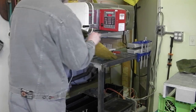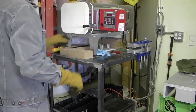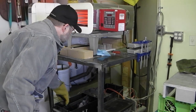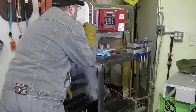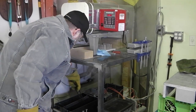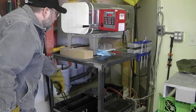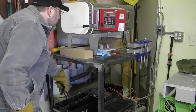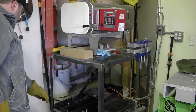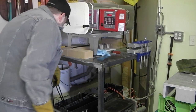I'm going to shut the kiln off so I don't electrocute myself and pull the blade out. I'll do the first one - flip it upside down, tip first into the oil. I'm stabbing into the oil. Then I'll turn the kiln back on so it runs the program again and gets back up to temperature, because it dropped - now it's 1,436 degrees. Let's see if it's straight - and it's straight. Looks good.